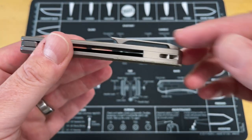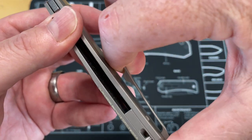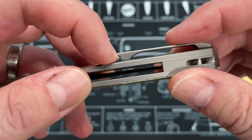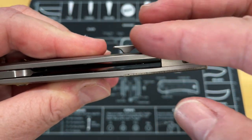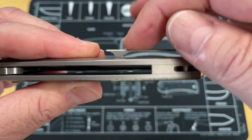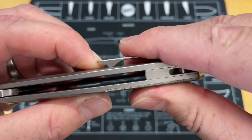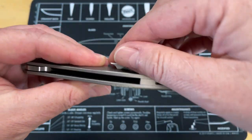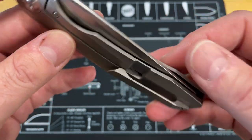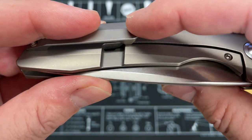So if you're in public, now coming out of pocket, not an issue, but trying to get that material up under this fairly stiff pocket clip with that very, very strong angle there, this needed to be tapered instead of hollowed. You could have gotten away with this much tension if that was a V taper to push the material down instead of it binding up there. If you did a V, it would have pushed that up. Definitely an issue.